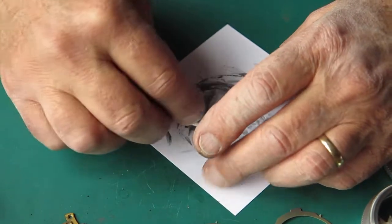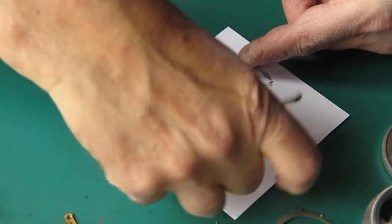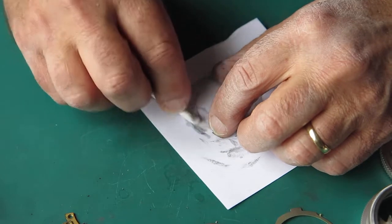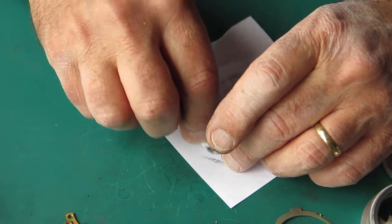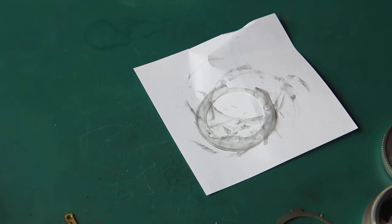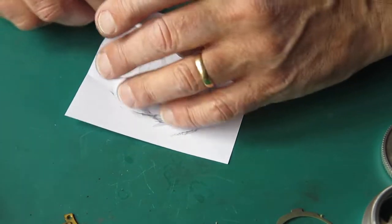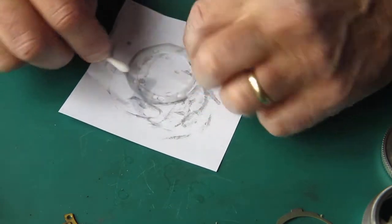Yeah, this piece of plastic's not in a particularly pretty shape. I think it's being dragged backwards and forwards by the focus scale ring part. And that grease, there's like little microscopic bits of grit embedded in the plastic that almost certainly were brought in and, or held in place by that grease.